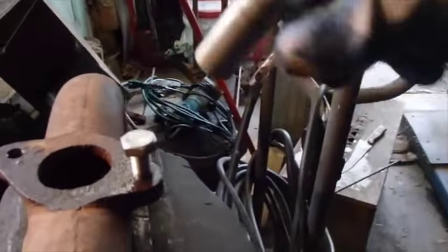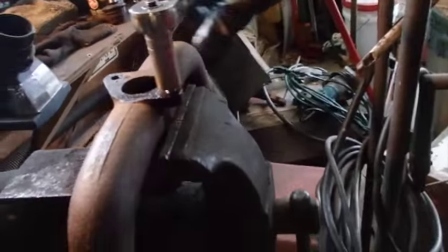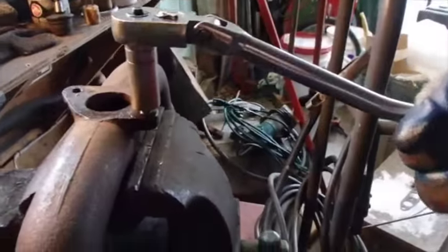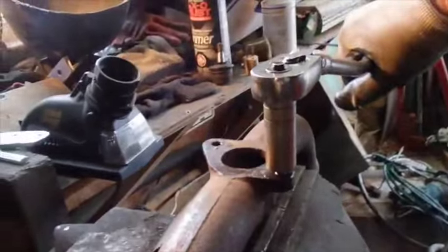You want to do this gently because obviously you don't want to screw something down in there and break it off. What I've been doing is working this in, taking it back out, working it back in, taking it back out. Every time I take it out I clean that groove out so I'm cleaning out the stuff because it'll collect dirt and crud in those threads.